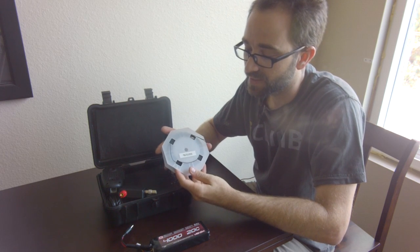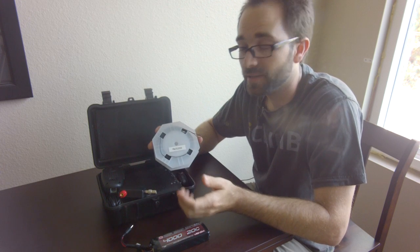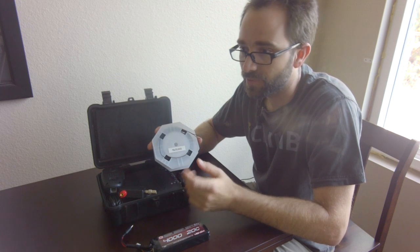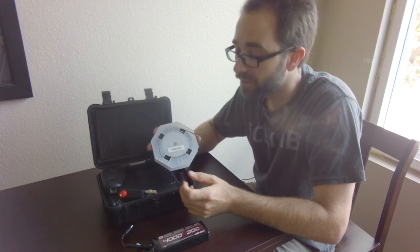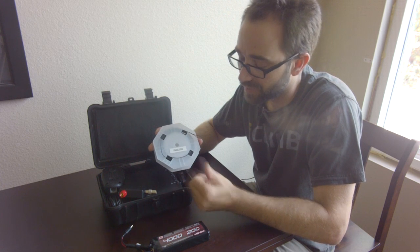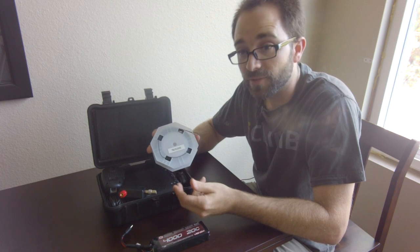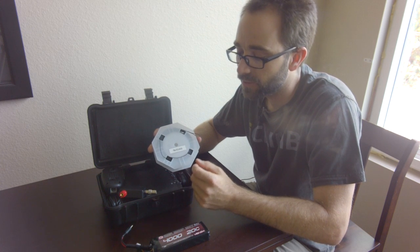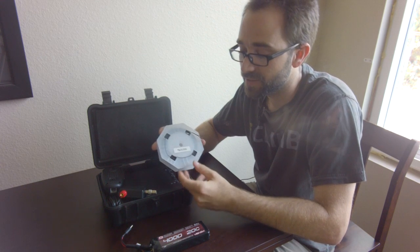Second thing in here is my off-center fed dipole. I came up with this antenna design because it lets me operate on all the bands from 80 to 10 meters, except for sometimes 17 and 15 don't cooperate, and 12. But 80, 40, 20, usually 15 and 10 work with a reasonably low SWR without an antenna tuner.